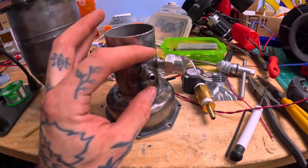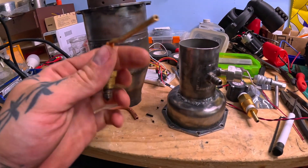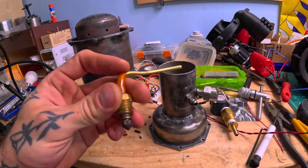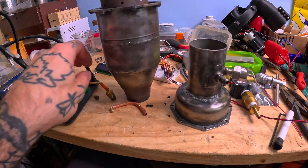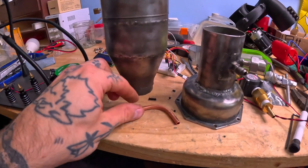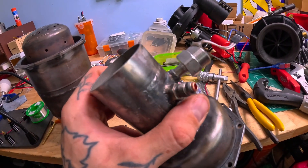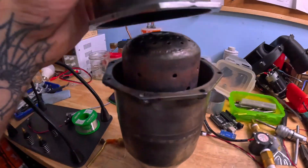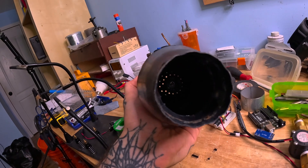This here is what I'm going to be hooking my fuel line onto. Previously the fuel line just went in up there — fuel through into the nozzle, the nozzle is threaded in, and that's all it is. This new one is the same idea. It fits together — it's poking out at that end, I'll crimp that over, and then it just sits like that and shoots the fuel right into the combustion chamber.